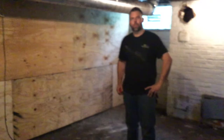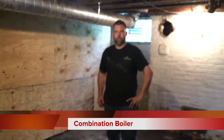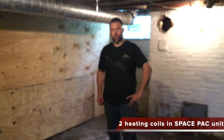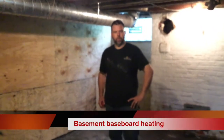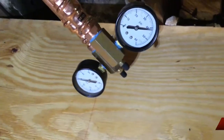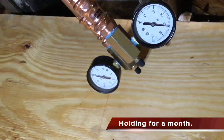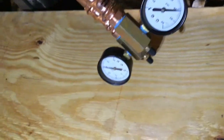Right here is the wall area for our boiler system. It's going to be a combination boiler — heating and domestic hot water. It will take care of two heating coils: one in our first floor space pack and one in the third and second floor space pack. Then we'll have another zone in the basement for traditional three-quarter inch baseboard. The coil on the third floor has been on pressure for about a month with no leaks, which is always a good thing.